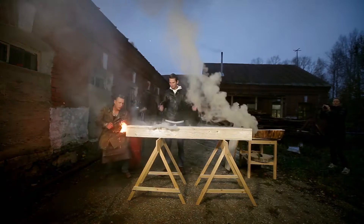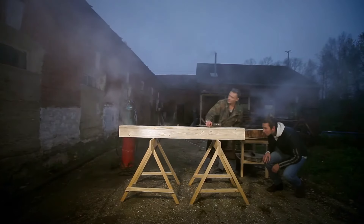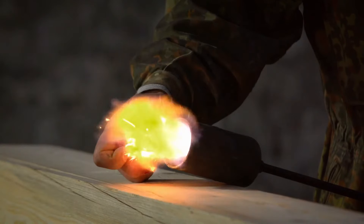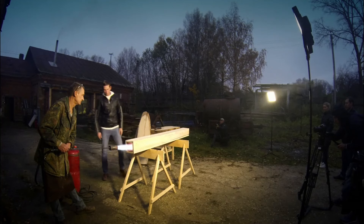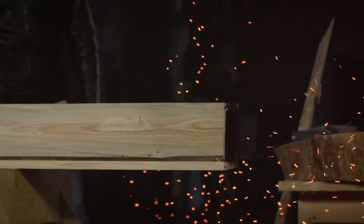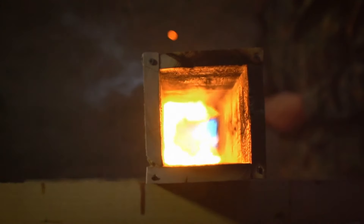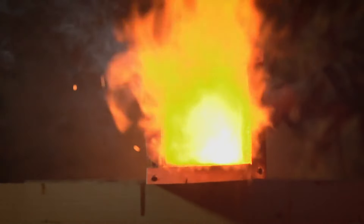Do you want to say that after that the wood will become stronger? Only the resinous layers will become stronger. In the course of thermal decomposition, under high temperature stress, the so-called fiber channels in the outer plies get narrower, filled with tar and combustion products. As a result, the board really becomes stronger. Besides, the burned layer protects it from harmful insects and fungi.